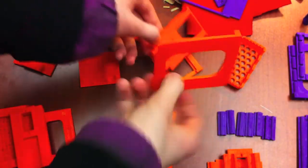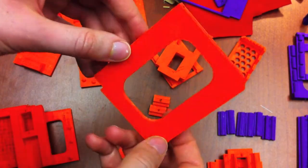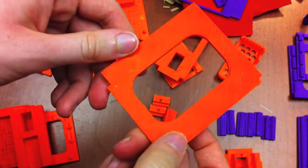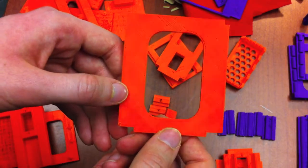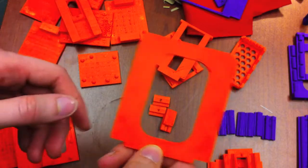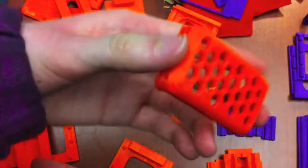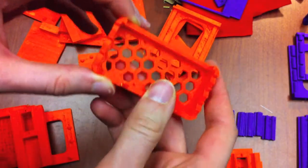Another thing that was changed from the previous test to this one was that in Skeinforge — or however it is pronounced — I changed the extrusion so that instead of being 90 degrees, it's now 45 degrees. This leaves it with an interesting diagonal look, and also not printing with a raft anymore, so that's what gives it the shine from printing directly onto the build plate.